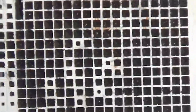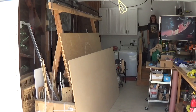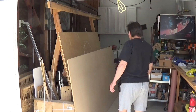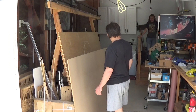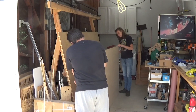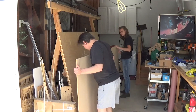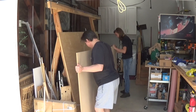The test proved that I could get consistent and accurate pixels — time to move on. I decided to use a half inch sheet of MDF. I was concerned about weight since this is going to hang on my wall, but the next thickness down was quarter inch, and to get the size pixels I wanted I needed to cut almost exactly a quarter inch deep. I decided to use a French cleat for hanging, and in the end weight wasn't an issue.